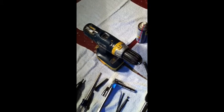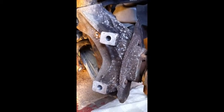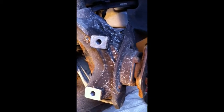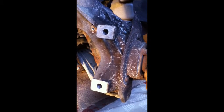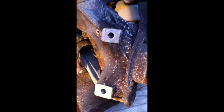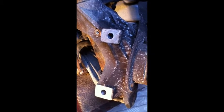First I need to put the new drill bit in my drill and drill out the holes. Okay, those holes are now bored out to the slightly larger size. I should mention that I used a bit of WD-40 to help the drill bit along so it doesn't overheat. I'll also be using WD-40 when I tap out the holes — I know some people use a specific cutting fluid for aluminium, but quite a few people use WD-40 and I find it works pretty well with aluminium for cutting threads.